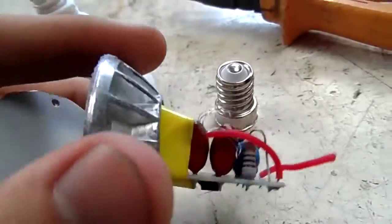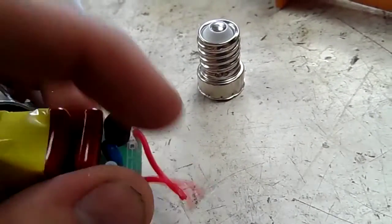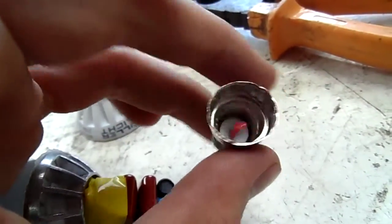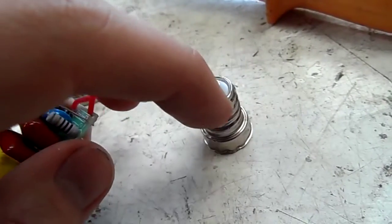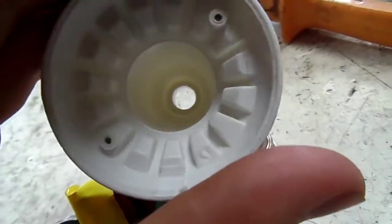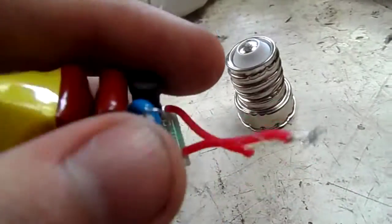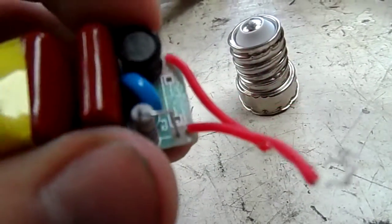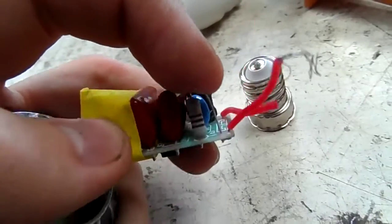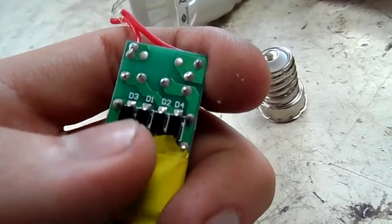Well, that's everything that's inside an LED light. There is a power pack inverter on it. You've got your 240-volt AC coming in from the light terminal through the cap. These wires weren't even soldered on — they must have just been pressed up against the cap and the pin at the end when it was crimped onto the plastic housing, which is just one-piece construction. You've got a little RFI suppression choke to get rid of any noise, then two filter caps and some kind of resistor — not sure whether it's a ballast resistor or not. And that's your bridge rectifier on the bottom — diodes 1, 2, 3, and 4.